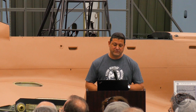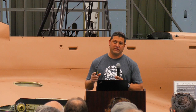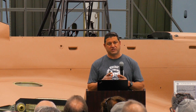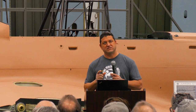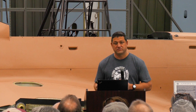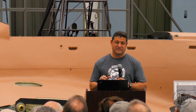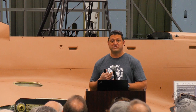They hadn't fully assembled the propeller other than once in the shop. What's unique and the reason we built it here and shipped it complete to Tehachapi is this: when you remove the blades, the propeller blade has a cone that sits in there, and that cone has two weak points by design — so you can get the nut back off if you ever need to change a blade. The issue is the cone breaks every time you take a blade out. You just have to have spare cones. It was critical that when we assembled the propeller, you had to do it right the first time — you couldn't back the nut off and take another swing. That's not something they trusted us with, quite frankly, so they came over to show us.